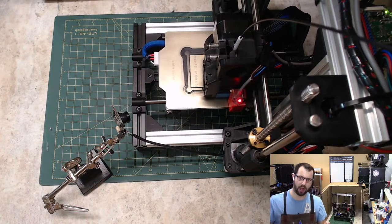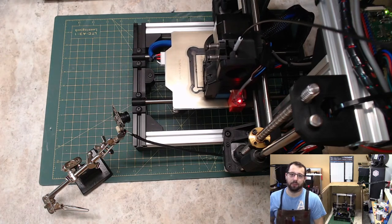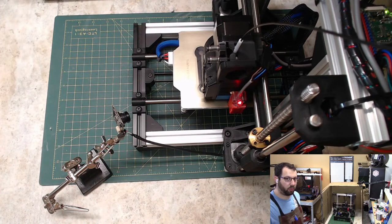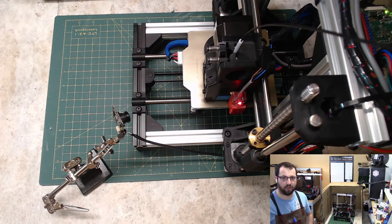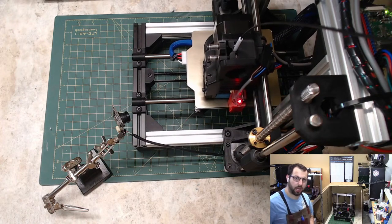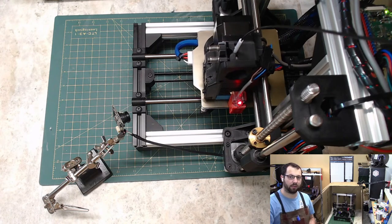But yeah, with CoreXY or CoreXZ, normally the gantry would just come plummeting down if you turned off the printer, or the motors would constantly be working to keep it up. So we actually have a keyback, it's called. It's actually just a retractable key retainer, but it holds 20 ounces, and that's enough to basically act as a counterweight.